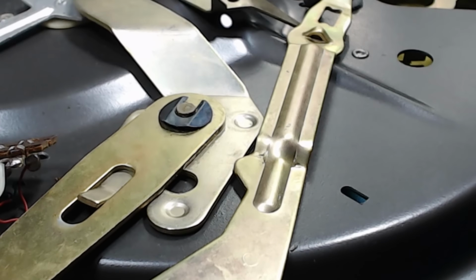I'll just make sure I can see grease in there, so I'll take it out, clean it up, put a bit more in. This linkage assembly here is the speed selector. If I put my hand under here and operate this speed selector, it moves this mechanism here. It's just slow. If you watch, it'll just take its time to get in there. It's packed up with grease. This is a roller, and it does move. It's loosening up as I run it. I'll pull that apart and re-lubricate it.